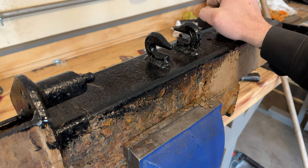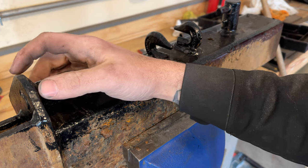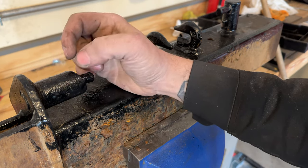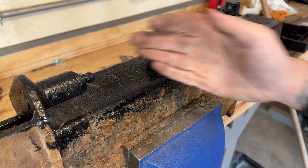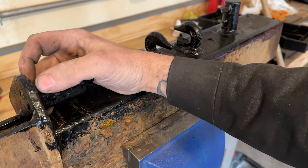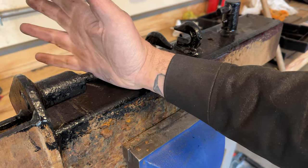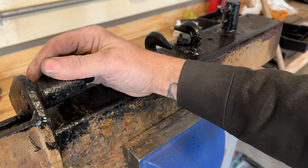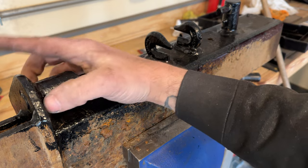So what we're going to do is cut this off, clean the weld off, and the customer has a new one handy — we're going to put it on and weld it around. Pretty simple job. I normally would just take a torch and cut this clean off, then grind down the weld to separate it. This could be a job for an air arc gouger, but realistically the time it would take to set that up, it's still faster to just cut this off and polish the weld off.